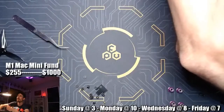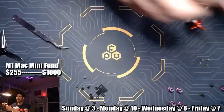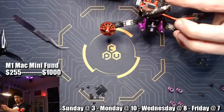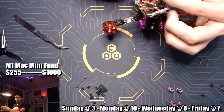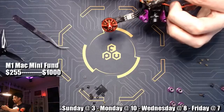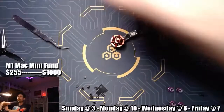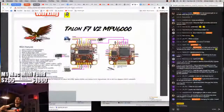Although, let me just check it one more time. Okay, so Mamba F35 is ground, VCC, motor 1, and then the last one is current, which is yellow. Current is yellow. And then on the Talon, it's VBAT, grounds.